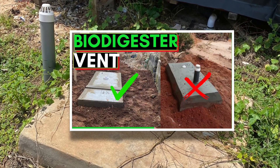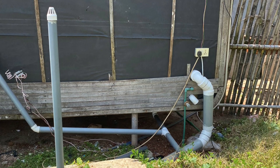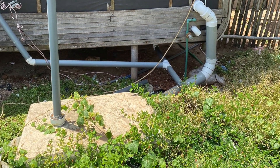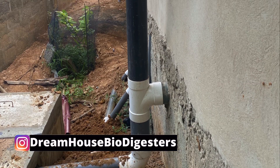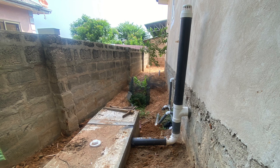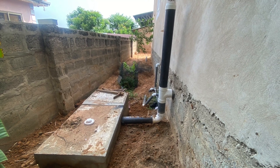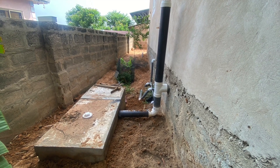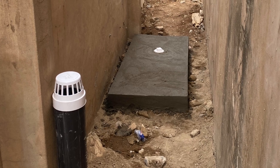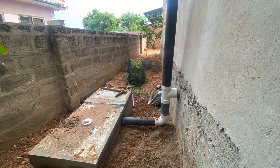When I did a video about not putting vent pipes on a biodigester, I still insist: the next time you construct a biodigester — for yourself, a client, or anyone — you must insist that the vent pipe must not be put on it. Biodigesters are on-site biodegradable systems that do not require air; they use anaerobic digestion to biodegrade human waste, which means the digester must be sealed tight.